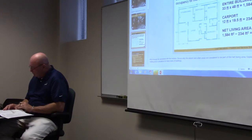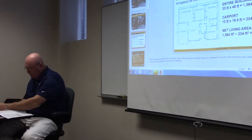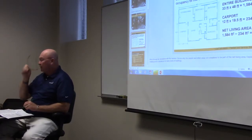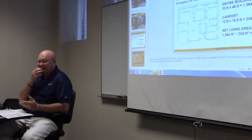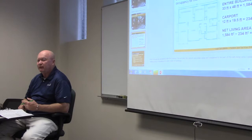All right, Cameron, I know you don't have the answer, but how about reading the next one and we'll help you get to it. Each small appliance load in a dwelling must be calculated at a blank, and there must be a minimum of blank. The answer is 1,500 volt amps, and there is a minimum of 2. Where are those small appliance circuits going to be? Kitchen countertop, most likely. You're going to have microwaves and toasters and coffee makers and whatever else. So two 1,500 volt amp circuits for small appliances that go on your kitchen countertop. Everybody got that one?